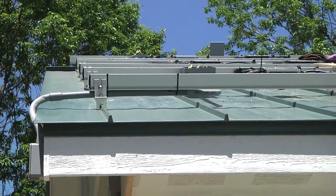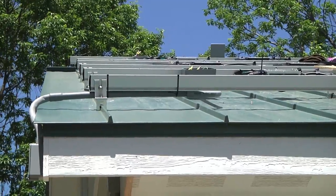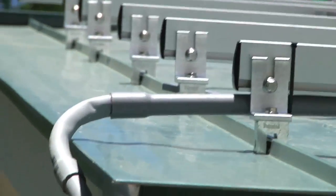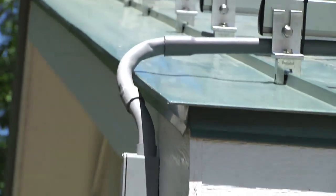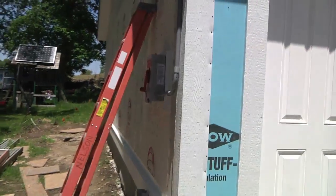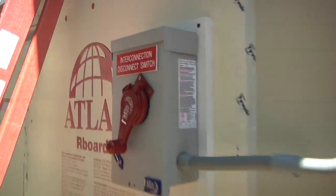From the view on the ground, this is the bottom left, the southwest corner of the garage. I did a little magic with a couple of pieces of conduit, kind of bending them just a little bit to go to that pulling body, which then goes to a second pulling body that goes down along the corner, and then follows an elbow to the disconnect.